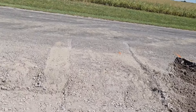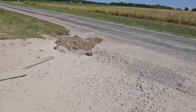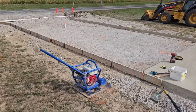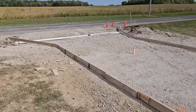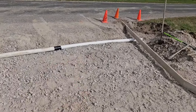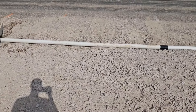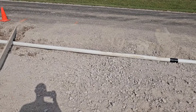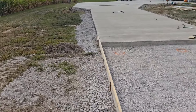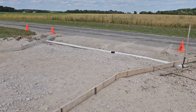So we're going to get the form in and then probably backfill around it, and then take it out again when we're ready to go. At least it'll be in place. I am going to get some cones and put them along the road so there's somewhat of a warning. We've got a few more stakes put in, forms are all set, grade is good. I've got to dig out along the road there - like I said, we're going to wait to do that. I do however want to put some more fill in, cover that pipe up. We need to go get some good stone, some 4-1-1s that don't have the biggest stuff in it, get that buried, and run the tamper over everything.